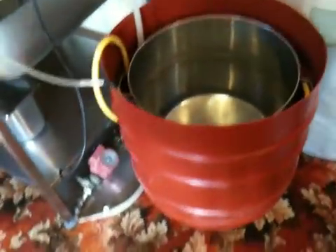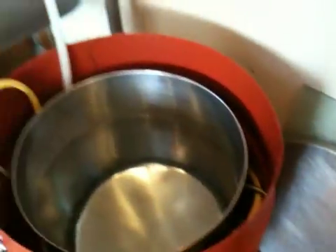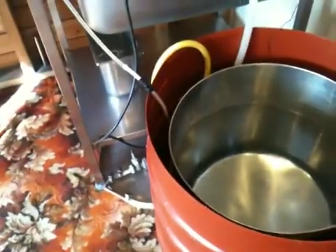What's happening is the water jacket is being stirred by this pump here. It's a standard central heating pump. It's coming out of the bottom of the plastic container and being pumped round and back in — this is the kind of flow it's achieving. Good hose pipe kind of flow. So that is just recirculating and the idea is it's generating a swirl effect, which means that the water in the water jacket is a constant temperature.